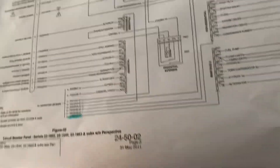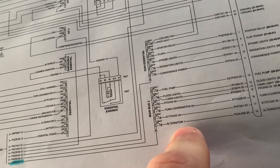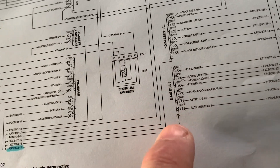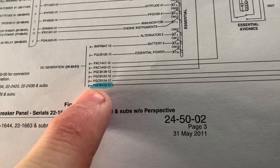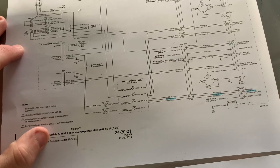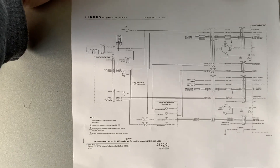Real troubleshooting: no power to the fuel pump, flood lights, or the autopilot system. Conveniently, those are all tied to main bus two. The power source to main bus two is that connector right there. We're going to go through the battery and check everything for continuity - it's probably just a popped fuse somewhere, but we'll figure it out.